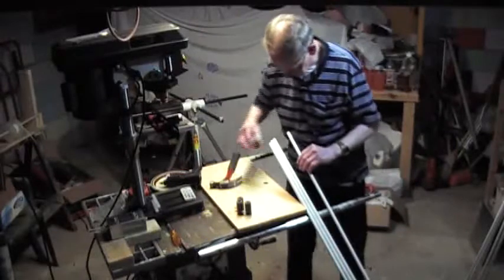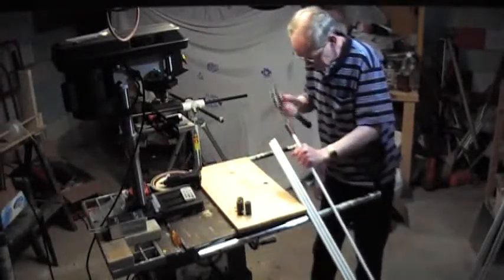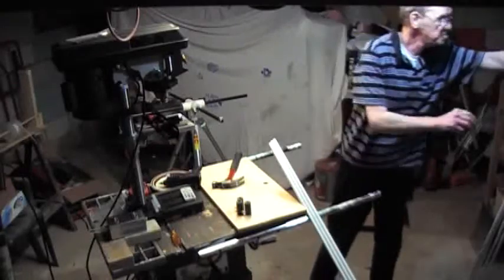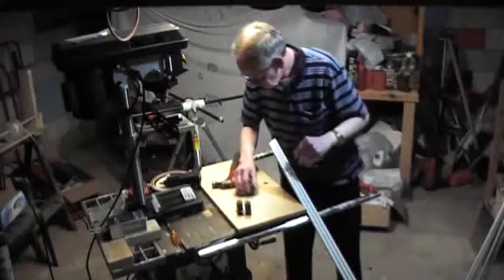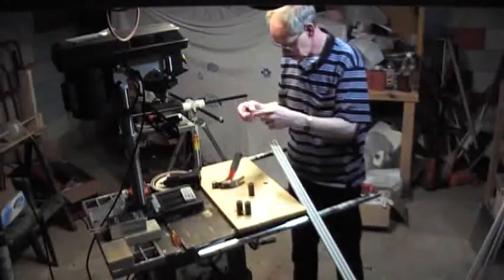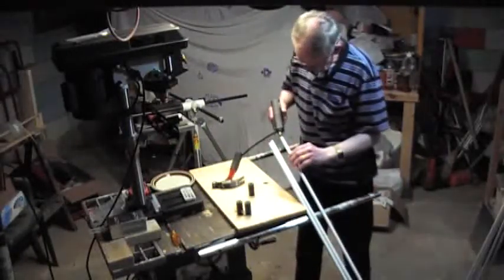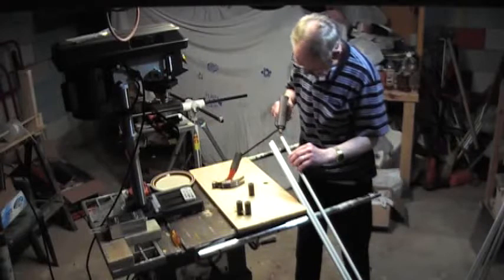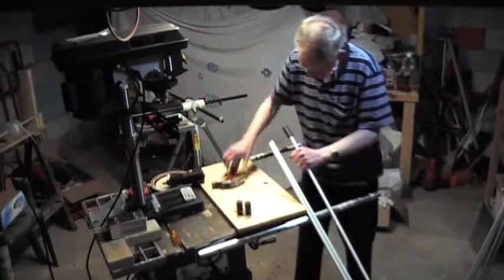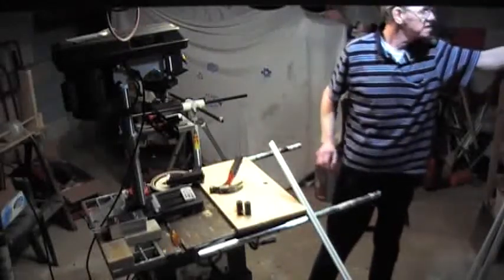The only other thing I have, other than actually putting the quad together and stringing the wire, is the small project block where the coax actually goes onto the antenna. It goes through the project block with two wires and hooks to the end of the loop wires for the driven element. I've got a little thing to do to make it all go together a little easier — I'll show you what that's all about as soon as we get done here.